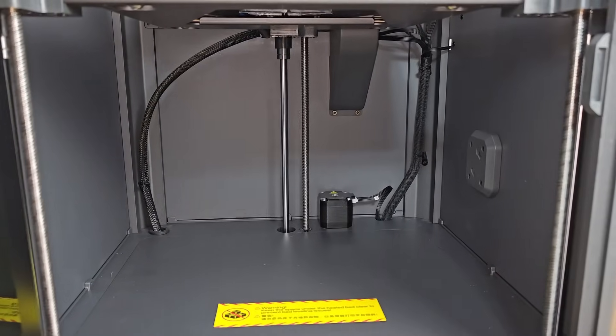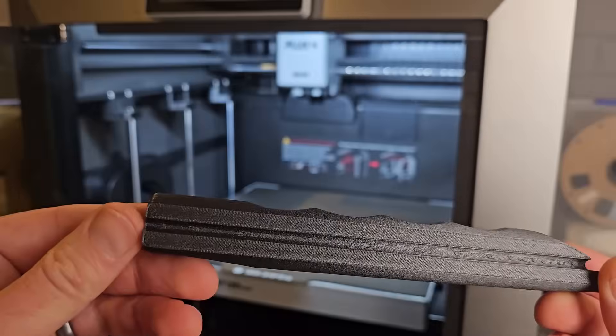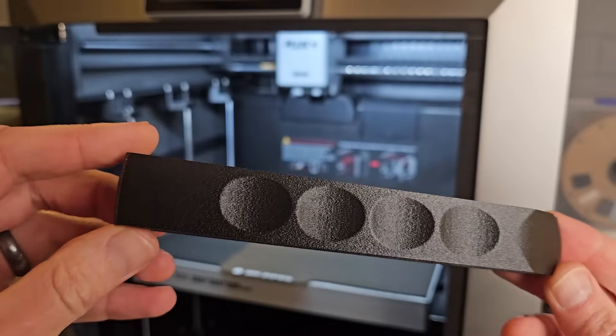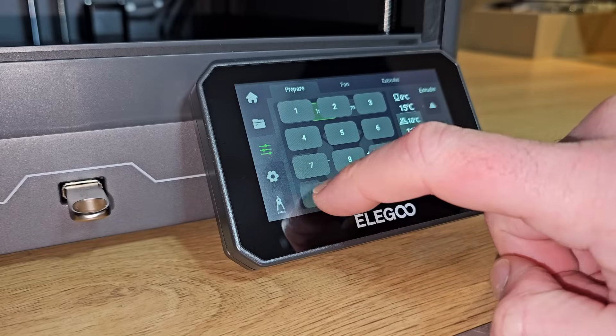To see what's going on inside, there's a camera with an LED light, which in my opinion isn't bright enough. One thing that I felt was a missed opportunity is the lack of a chamber heater. I've been printing a lot with the Creality K1C over the winter months and its chamber heater makes it more versatile when printing with filaments designed for engineering purposes like nylon, ASA and even ABS. These filaments are well within the range of what the Centauri Carbon can do with regards to nozzle and bed temperatures, but to prevent warping you need a chamber heater. The bed will heat the chamber a bit and you can set it to heat a while before your print starts, but a dedicated chamber heater would make stronger prints easier to achieve.